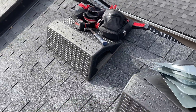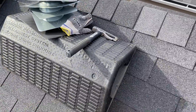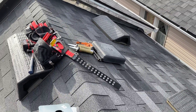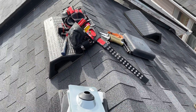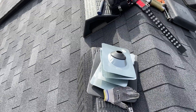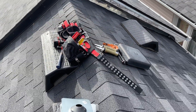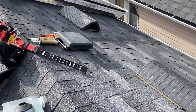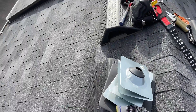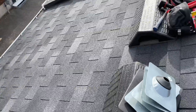It's about a 7/12 pitch, so what we did was bring the pitch hoppers up. Two of them are directly below where we have to do our work, and then the other two we're gonna hold materials and tools. These things are a lifesaver — gonna make this job way easier, no need for jacks and planks. You can do this just standing on it, but as soon as you drop something it's gonna go rolling down.